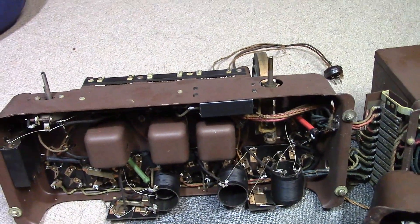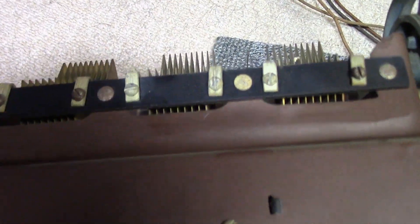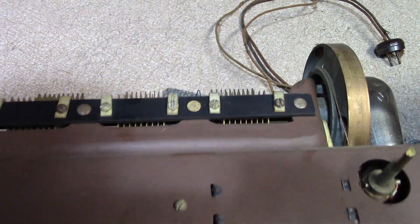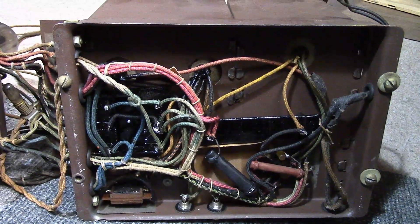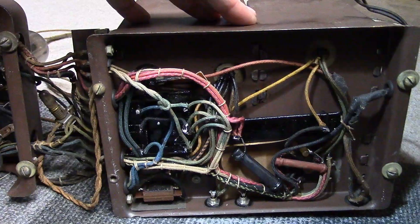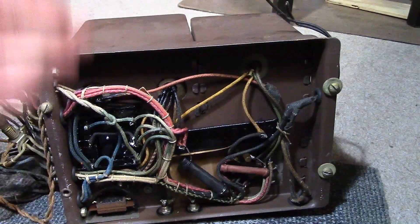One thing I'm curious about: I have a friend working on one of these and his has braided bronze dial cord. The pot metal on his has cracks and is epoxied together. Both of mine look to be in good shape, though they're a slightly different color — maybe this one was around a heavy smoker. The dial scale is cracked on the old one. I can also see some nasty corrosion, and I didn't get the knobs — though I have a set. There's cadmium corrosion on the old one, whereas this one does not have it. When it's yellowish, that's cadmium sulfate or sulfide.